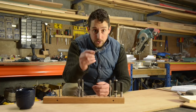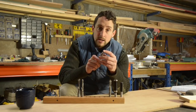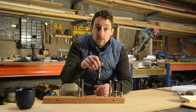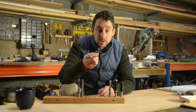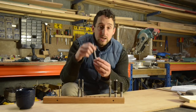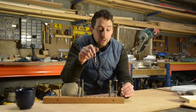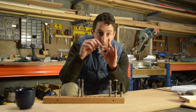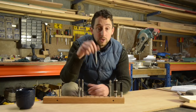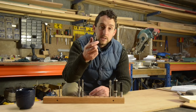Because these are acting essentially like a drill bit, they also allow you to do really nice clean mortises in ways you just can't do with a standard straight bit. Because this end acts exactly like a drill bit, you can plunge in as deep as you want. Ideally you probably wouldn't want to plunge in a full 50mm and try to mortise out that whole section in one go — it's just far too much pressure on the bit and mainly on your machine. But you can still plunge in and do a few passes without having to do that floating plunge you have to do with a standard straight bit. Really nice mortises, excellent chip ejection — if you're creating a nice narrow mortise, you're not going to get clogged up. It's always going to come out the top.